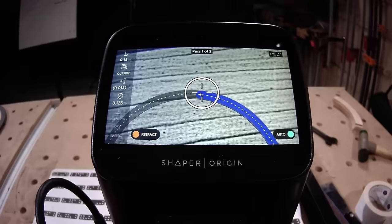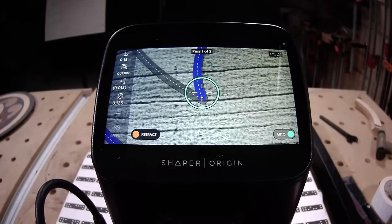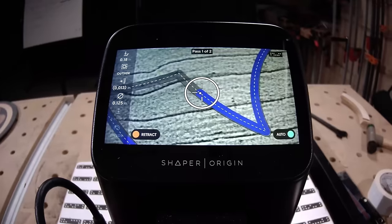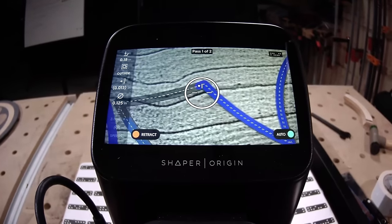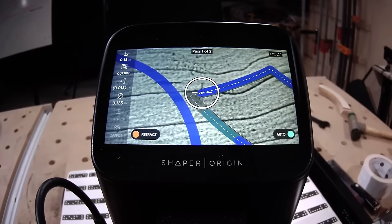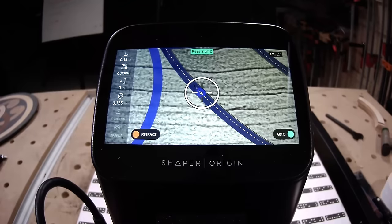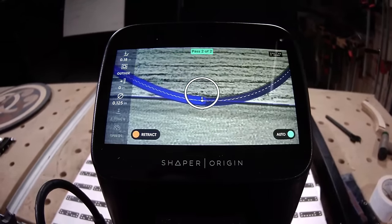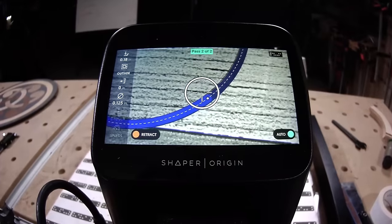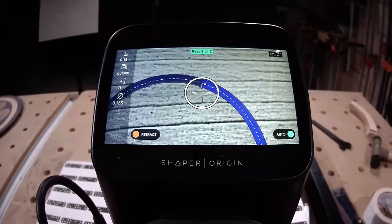So Jake's cruising through these on AutoPass. A little bit of context about AutoPass. You could do this stuff where you do a roughing pass, what we call it, with a global offset, and then change that global offset to do a finishing pass. But what AutoPass does, which is really nice for you, is it saves you a lot of time and automates that step. So there's less of a chance of mashing your fingers into the wrong button accidentally, which happens even to the best of us.